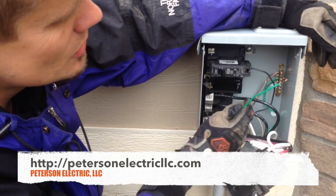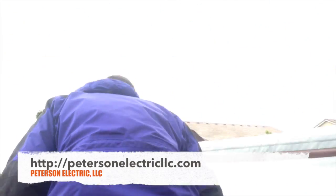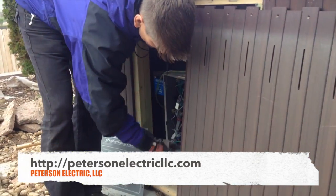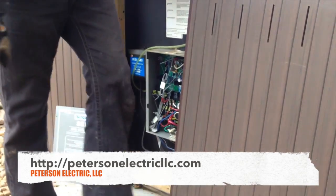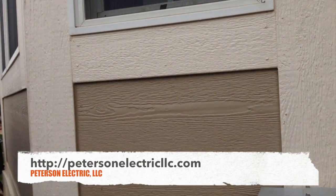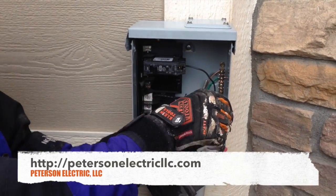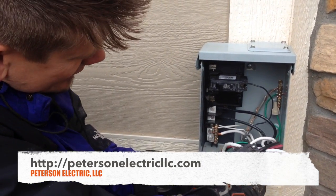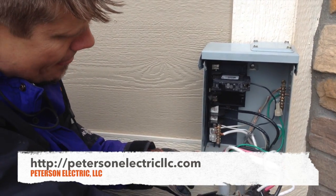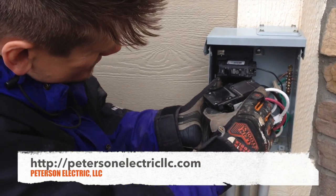Now that we did, the thing you've got to do is disconnect this — you cannot do that on a four-wire tub or you will blow that GFI as a nuisance trip. I already cut it and I'll cap it at both ends. This is not a four-wire tub. Per manufacturer's instructions, you've got to isolate that ground off — there is no need for it. So we're going to cap this in here. Now our neutrals are separated. Our neutral coming in goes to the bar, then it senses to the GFCI, from the GFCI to the hot tub.